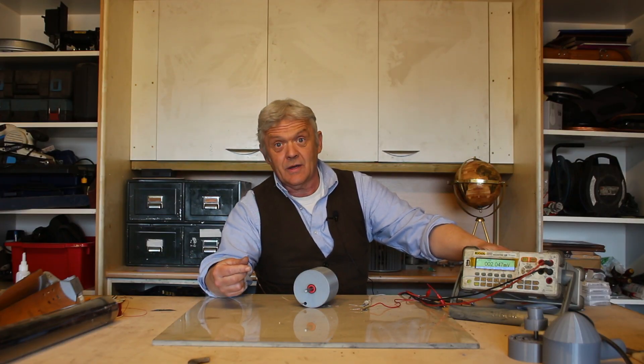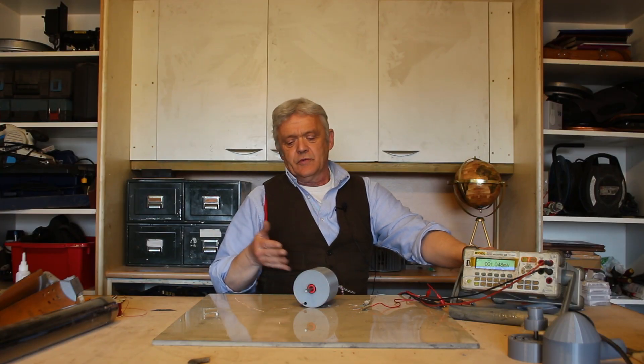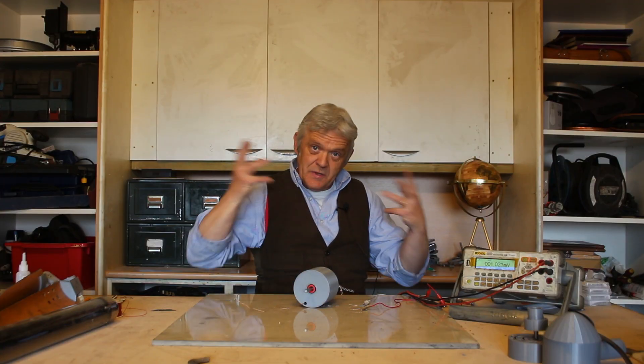One question is: what wire am I using? I use 0.2mm wire because the voltage generated is BLV sine theta — where B is the strength of the magnetic field, L is the length of wire, V is the speed at which it turns, and sine theta is the angle the wire makes with the magnetic field. That's why we've concentrated so hard on making the wire a straight line, because sine theta of a straight line is 1 — the biggest it can be. As the angle changes it drops below 1, which reduces generation quite dramatically.